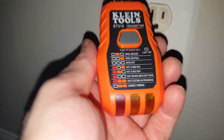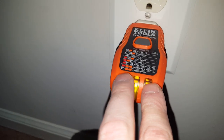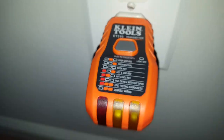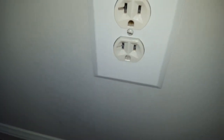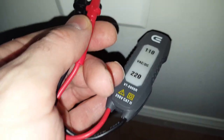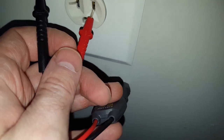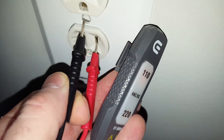Here we see it in action. If you see two lights on this particular one, then it's good — it's wired properly and working properly. Correct wiring. Here's another quick way to test to see if it's live at 120 volts. You can also put one lead in the hot and one lead anywhere metal to see if it's grounded. If it's grounded, the 120 volts will return through the ground, and it lights up just like that, so you know it's grounded.